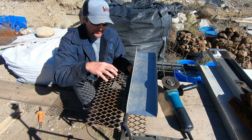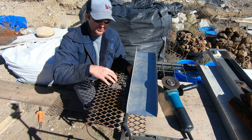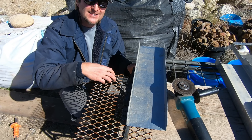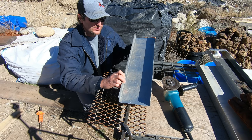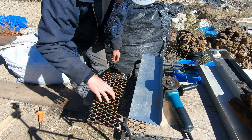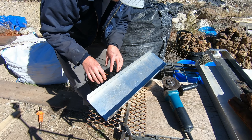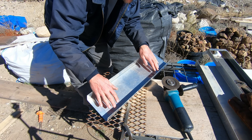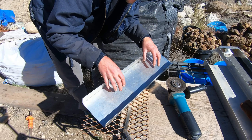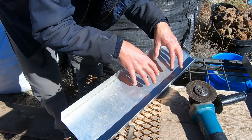The whole reason I built that secondary sluice for the bottom of the cube is to catch more concentrates for my black sand smelting test. I'm going to make an extra sluice to go on the end of my gold cube to capture more heavies so I have more concentrate for the smelt. I'll use this folded aluminum box with medium-size expanded metal, lay some miners moss in the bottom, and clamp the expanded metal over top. With this setup I should catch more fines, a lot more black sand — hopefully non-magnetic black sand, sulfides, and those sorts of things.